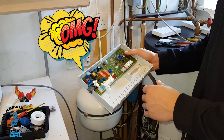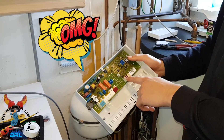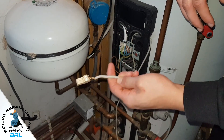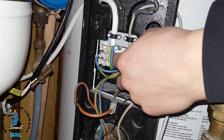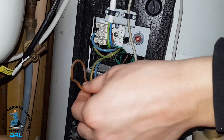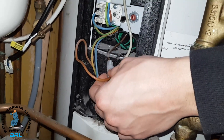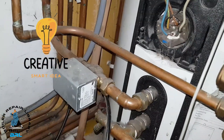So we've come up with another big problem: how are we going to control the hot water? The hot water was controlled electronically through this circuit board, and this lead actually sends the temperature of the hot water — we can't use this either. Here's the live feed coming in, which goes through the control stat, through the overheat stat, and comes out here going through to the immersion heater. We're going to take over this cable and connect it to our hot water zone valve down here.